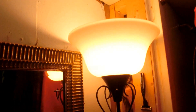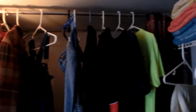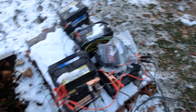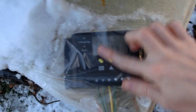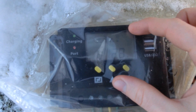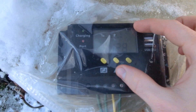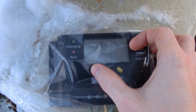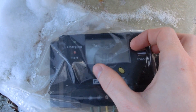Here we are back on inverter power at 30 watts, which brightens up the place a little bit. It's pulling the voltage down to 12.8 volts — pretty good. It's managing to pull less than 0.1 of an amp from the panels since it's pretty much evening now. We'll see how that goes.